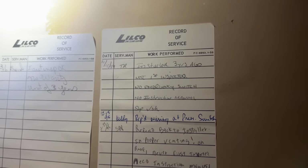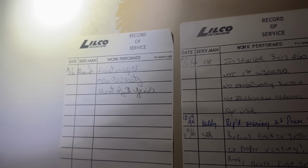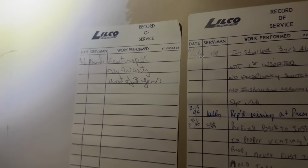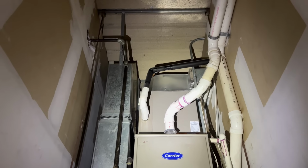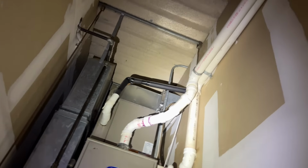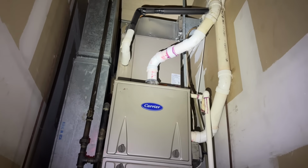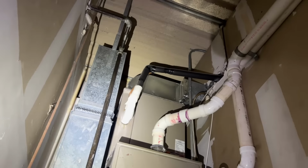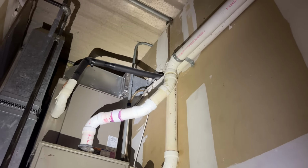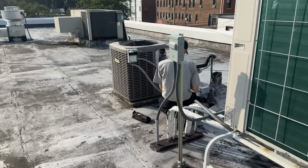1993. Wow. And then first inspection, okay. No warranty, unit of 3 years. That's obviously the previous furnace. And they put in a 90+% or high efficiency, you can tell by the intake and the exhaust flue piping, 2-inch PVC. Wow. But as predicted, that 3/8 copper is our liquid line. And they just probably use that as a sleeve. At least hopefully.